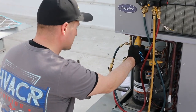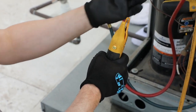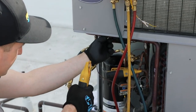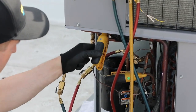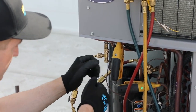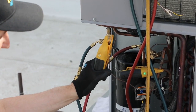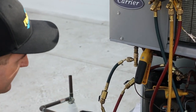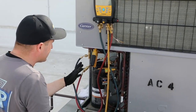Let's talk about the JobLink clamps. They have a new technology called Rapid Rail technology. What it does is it actually completes the circuit once it touches a conductive surface. We have a copper pipe here — it's important to make sure the surface is clean, but if there's a little grime on it, all you have to do is put it on and move the clamp back and forth a couple times, and it actually helps to clean the surface. If that doesn't do it, use some sand cloth and shine it up. When I disconnect, there's an audible tone saying we don't have connection, and once I make connection there's an audible tone confirming we're connected. These clamps are not affected by ambient temperature because of the Rapid Rail technology, and they have instantaneous temperature readings visible in a couple seconds.